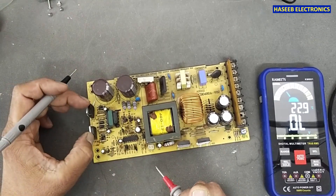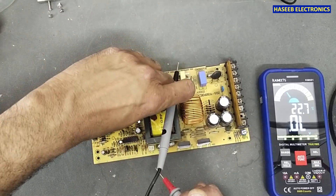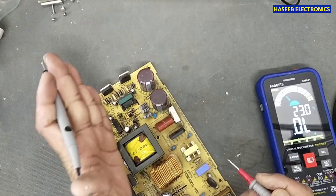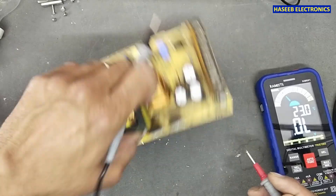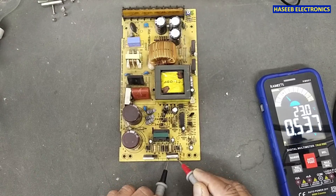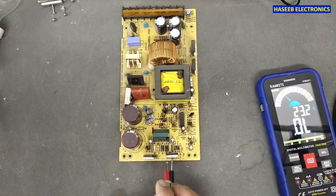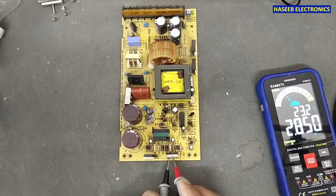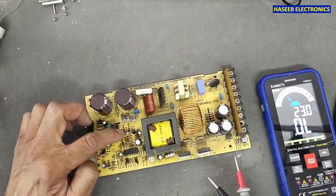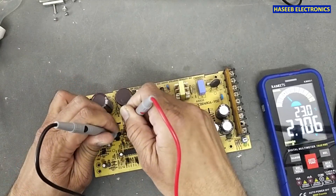So that means we need to check these power transistors, because this one is heating up. It is a 2SC4706 — the leftmost pin is base, center is collector, right side is emitter. This is an NPN type. Testing base to collector: 498, 534 — this is good. Protection diode collector to emitter — good. All indications are good. Now we need to test these two transistors which are signal amplifiers. Rectifiers and zeners are also good.